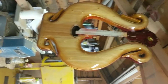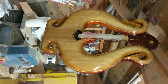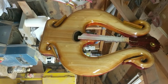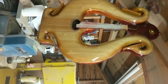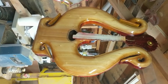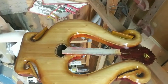I thought I'd give you a quick look straight from the spray gun — how this has turned out. I'm really pleased with it. Because of the shape of it and stuff, I didn't want to go for a perfect finish straight from the gun — the lacquer would have to be thinned too much for that, and with the shapes you'd be asking for runs. I'll probably put two coats of lacquer on it, then let it set for a few days, sand it back, and give it a light buffing and wax. I'm really pleased with this.